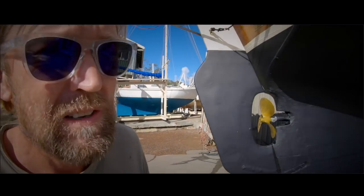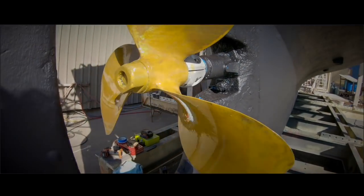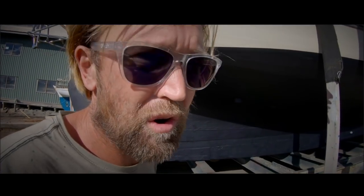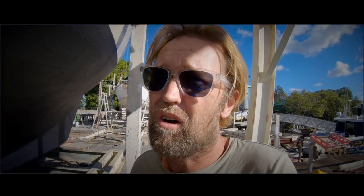The anchor winch is all done — I just need to wire it up. We've put on about 15 or 16 litres of antifoul, put on a new anode and had to cut it down to fit. We've just put some prop speed on, which is like a silicone coating — you never touch it. If the boat sits for a while and barnacles get on there, as soon as you put the engine in gear the barnacles fall off because they can't grip the silicone. I've touched up a few little marks on the paint, and Rowan, my dad, and Keith have been helping. Without them it would have taken a week rather than a day and a half.